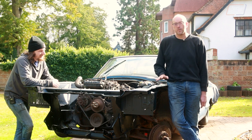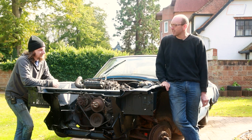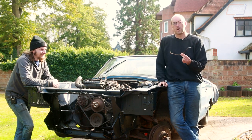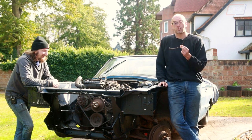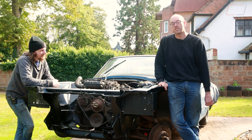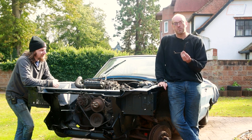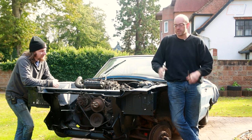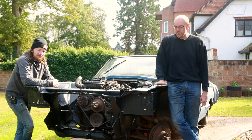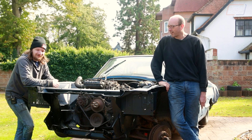The other part we wanted to do was overhaul the brakes, and I have all the parts for that, but unfortunately you kind of jinxed us by saying it would be a nice easy job. All of the brake pipes were rusted, which meant they tore when we took them off, and then the pistons got stuck in the calipers, so we screwed ourselves massively. Now we have to wait for new brake pipes, new calipers, and a bunch of other bits and pieces. This will hopefully be coming in episode 65 — watch that not work out that way.